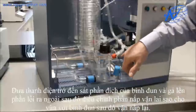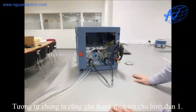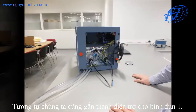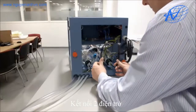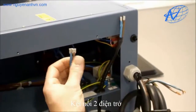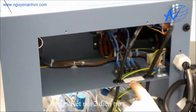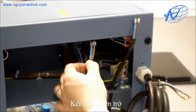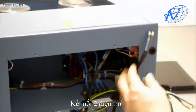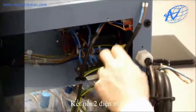We then connect our two electrical connections from our heaters. The front heater connectors are connected to the terminal block labelled front heater — blue to blue and brown to brown. The rear heater is connected to the rear two terminals, labelled brown to brown and blue to blue.